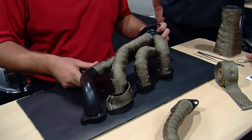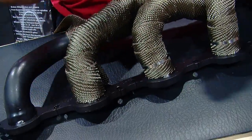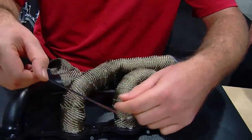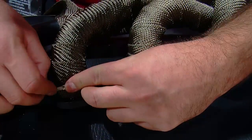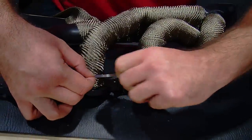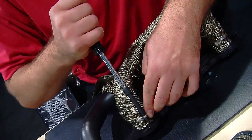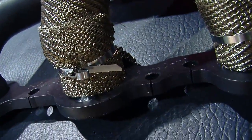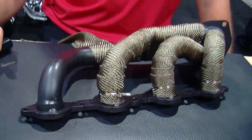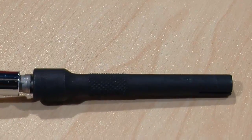Continue on that pipe and now I'll show you the locking tie and how to finish it off. Here's one of our stainless steel lock ties — simply wrap it around the pipe, push it through like a common zip tie, pull it tight, and then you can use our new locking tie tool. Slide it through, give it a little twist, clip it and you're done. The stainless lock ties are available in kits and you can also get them individually. You can pull them tighter, and it gives you that curve already. Then you can clip it, fold the end under, and it's going to hide that sharp edge.